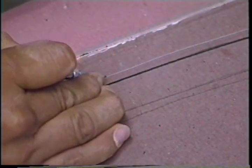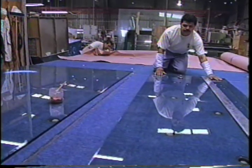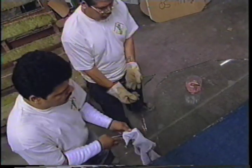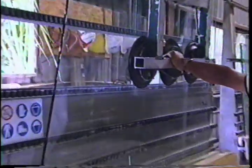The glass cutting process: the piece is put on a pneumatic table for ease of movement, the pattern is cut with a handheld diamond wheel, and pieces are chipped off using a special wide-mouth pair of pliers. After cutting, the glass is fed through a series of six diamond wheels of varying degrees of grit, then finished on a handheld machine on a gimbal — water-cooled — which does all the finishing and radiuses.